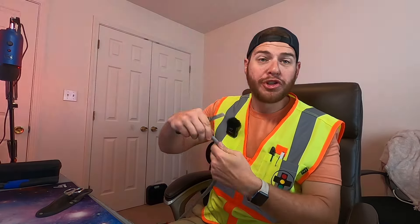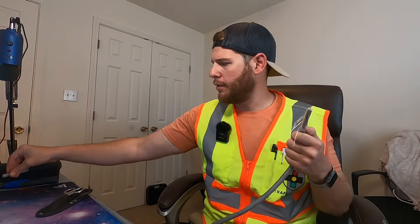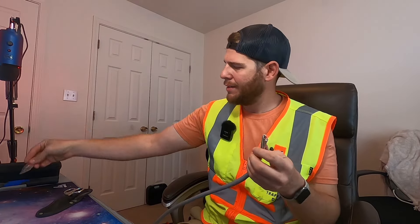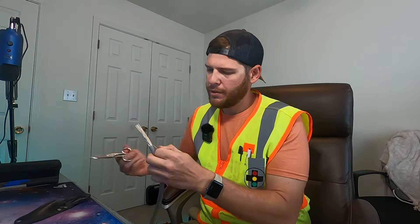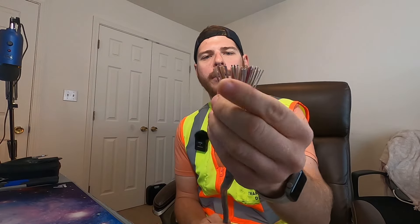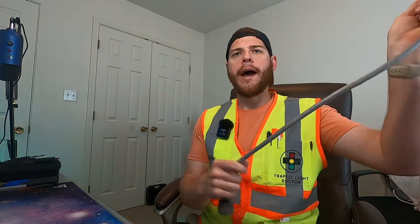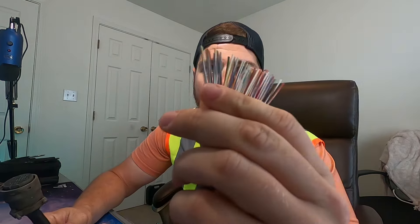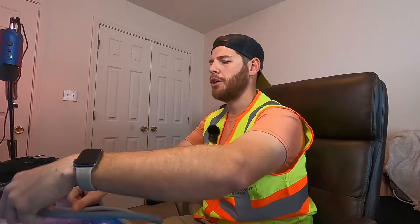Let's get all that pulled out and get the protectant plastics out of that. It does come with these little pull strings inside. Let's get our scissors and cut those back - we won't need them. Now we have all these cables right here - all these logic power wires and everything. This one is nice because it's color coded. Usually you won't have color-coded cables; they'll usually just be all blue cables. Because you've got a bunch of mixed-up cables, you don't know which one's your AC line, neutral, or ground, so we're going to hook a meter up to it.